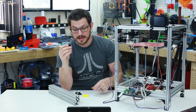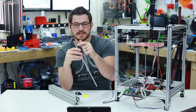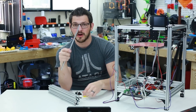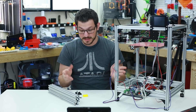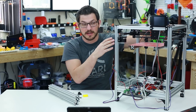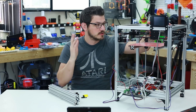I made them 8 millimeters longer so I can have a better hold on the end since the rod doesn't go all the way to the end as it should. I also added a second screw hole and made them captive so you can insert M3 lock nuts or nylocks — that makes it much easier to assemble. Tech2C's originals don't have any of that. There's one remix for the front motor mount and the other three are all the same, so you can download those from the Thingiverse link below.